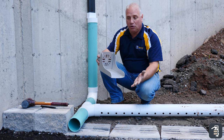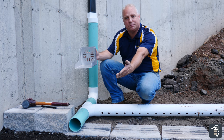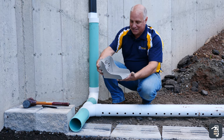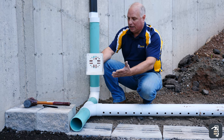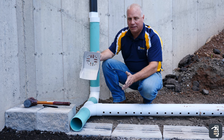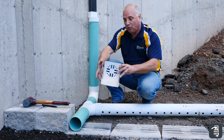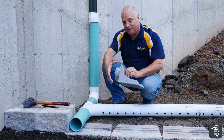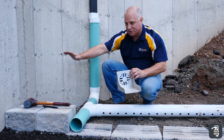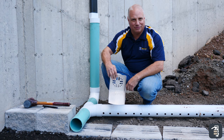The other reason is aesthetics. We would always extend our black pipe, white pipe, or green pipe eight inches beyond, and it really is unsightly. So this is a classy looking aluminum unit. It ties into your SDR 35, your four inch triple wall S&D. You simply slide it on there. We've created this at five and fifteen-sixteenths, so just shy of a six inch block, and your six inch block will ride right over the top of it and integrates into your wall just beautifully.